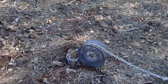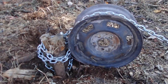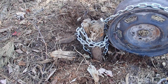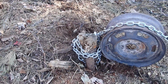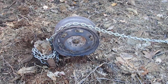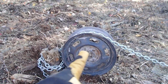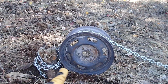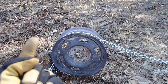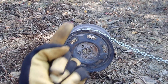We're doing spare tire/rim testing here. There's a big stump about eight inches in diameter that I couldn't pull out with a direct pull or with a pulley system. We're going to do a direct pull with a rim — the theory is that using this mechanical advantage, as you pull the chain, the stump will rise up instead of being pulled horizontally into the ground.